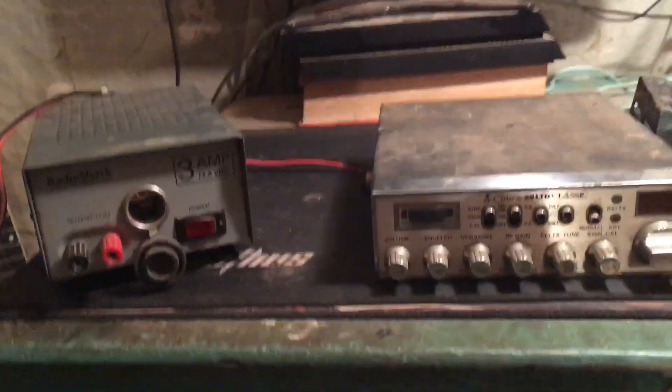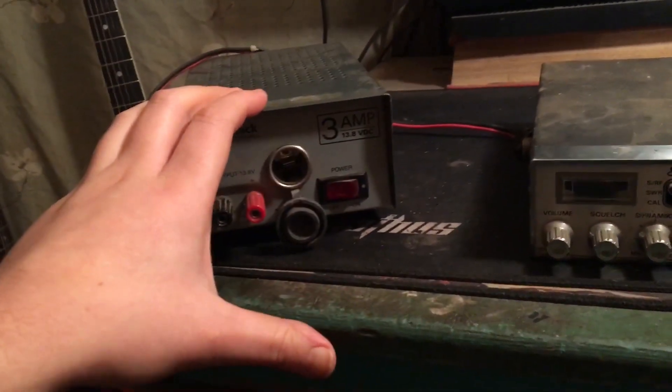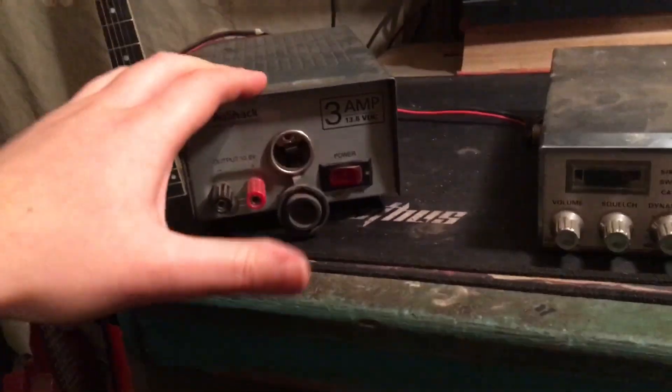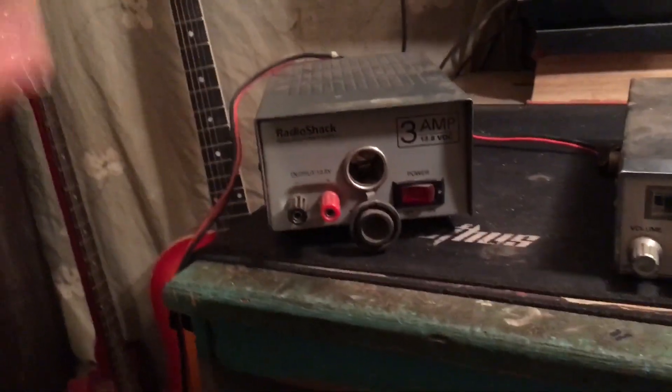If you're worried, you can look at your specs in your manual — it'll tell you how much it's supposed to pull. As long as you go over the fuse rating, you should be good. But if you don't use a 40-channel — let's say you're a sideband person — 3 amps probably won't do you. I would go more like 7 amps. You can't run this with a linear amplifier either; you're going to need 10, 15, or 20 amps depending on how much power they're putting out.